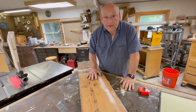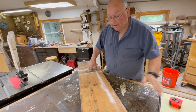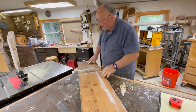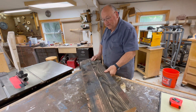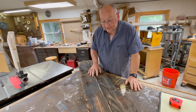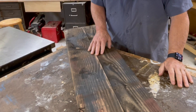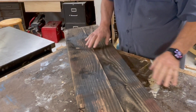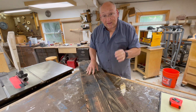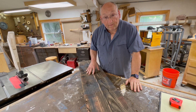I've got this short piece of 2x12 and the good thing is it'll give me plenty of room to cut that curve. The bad news is one side of it is in pretty bad shape — I might have put it on something to weld on. What I did was take 60-grit paper on my rotary sander and sanded the top of it just in case there were any metal filings, because against my better judgment I'm going to put this through the planer. I like clean squared-off stock to work with, particularly if I'm going to be gluing.